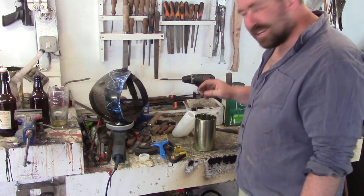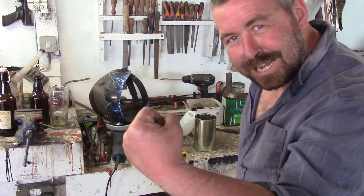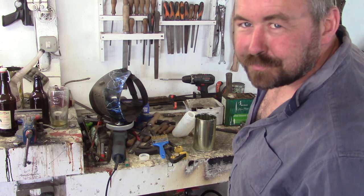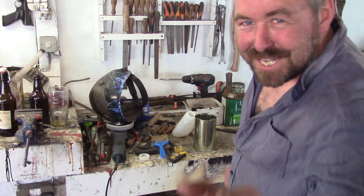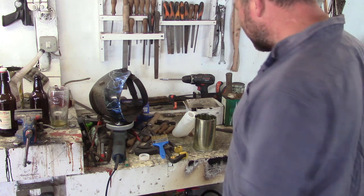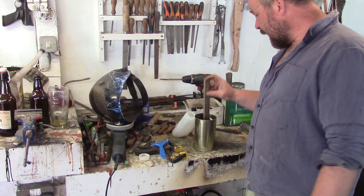works exceptionally well, and it dries very quickly, and it means that you can get another coat on there. It still delivers the same punch of oil deep into the fibres of the timber, but dries much quicker than if you thin it out with white spirits or terps or the other stuff, turpentine substitutes and whatnot. And it doesn't go funny.